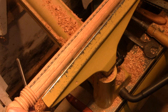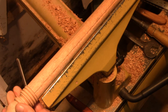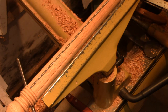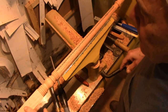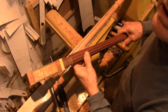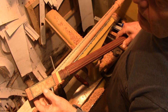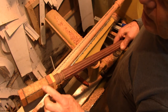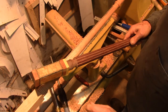The banding that I'm going to use will be black and white like this, but it's going to be a little bit different design. I've got to make six of these channels and then glue six of these pieces into here. And then of course, up in the top portion of the leg — the square portion of the leg — this will all be veneered in a pattern much like this. So I'll have some crotch maple in this area here, and then some banding around the outside and also a piece in the horizontal position here. And that's done on two faces. So this kind of inlay will be done on this area up here.